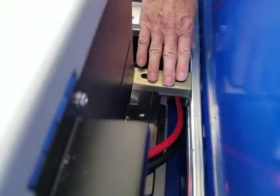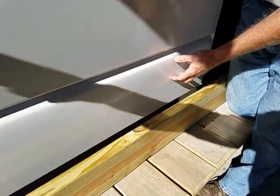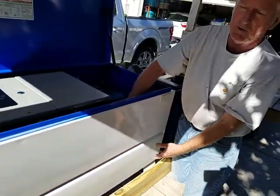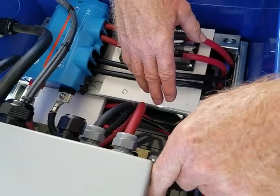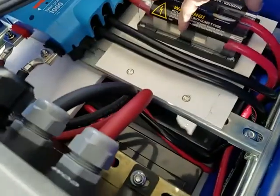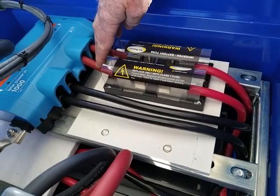And that's going to give us a positive separation between the energy storage devices, which are the batteries, located below this ridge. This box was selected so that we could get up to 20 kilowatt hours of batteries. These are lithium iron phosphate batteries. We only have 2 at this point in time, so we have 10 kilowatt hours of storage here. Creating this frame also allowed us to create some platforms where we could put our overcurrent protection. These are fuses on the positive leads coming from the batteries.